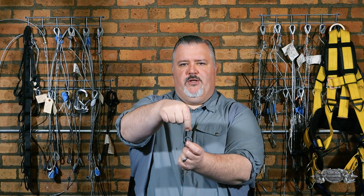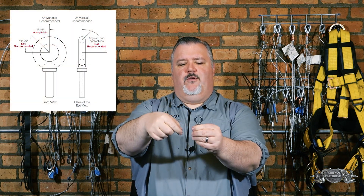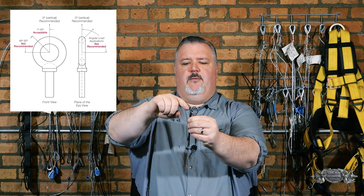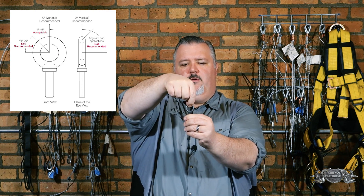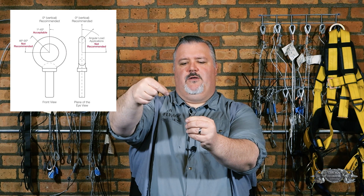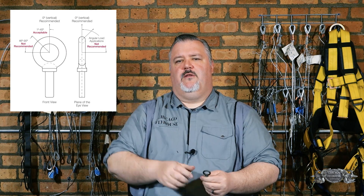We picked shouldered eye bolts and non-shouldered eye bolts. The difference is obviously the shoulder, but if you look at the manufacturer's specifications, what they're going to tell you is that the non-shouldered eye bolt is only good to be pulled on in one direction — a straight pull — whereas the shouldered eye bolts can withstand some sideways force. I can pull off axis, but only as far as 45 degrees off vertical. When I pull straight I get the full strength of the eye bolt; when I pull at 45 degrees I'm down to 25 percent of the strength. If I pull more sideways than that, it has no rated strength. So a lot of us are using these in ways that aren't quite what the manufacturer intended.